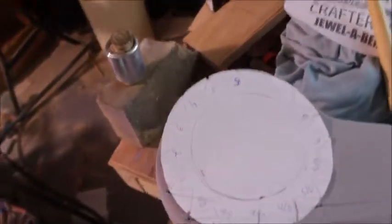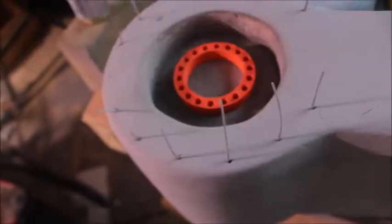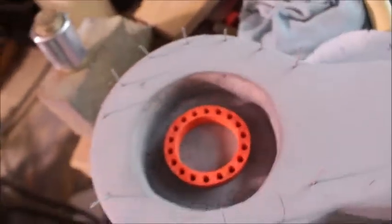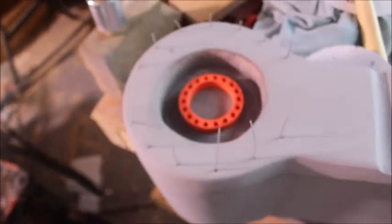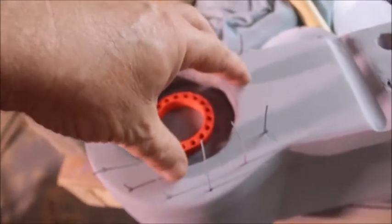And then I made me some patterns. Now, all these blade sizes are going to be marked on here. What I'm going to do, I got a vinyl cutter sitting in the house, and I cut me some vinyl letters that go right around here, and I'm going to build those up. Everything's going to be right in the mold.